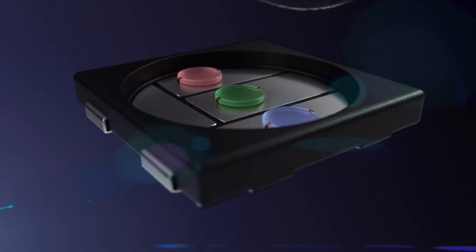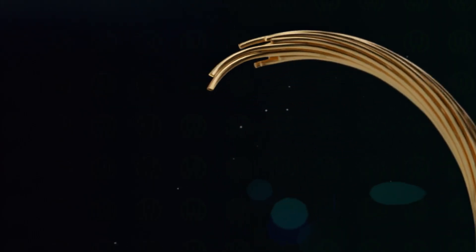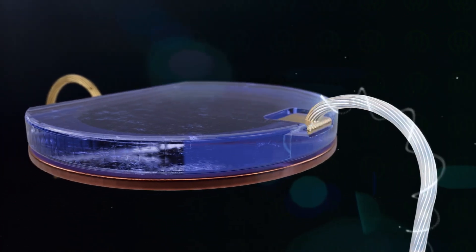So what exactly is chip on board technology? Let's take a look at what it's not. Traditional SMD displays require the actual diodes to be mounted in a package. That package contains the electronics necessary to manage the diodes and encapsulates them in a way that makes them easier to work with. However, that package creates limitations because they can only be made so small, and they require microscopic wires to be run inside the package to each RGB diode, which has an impact on energy consumption and heat. Typically they're white, which has an impact on contrast ratio.